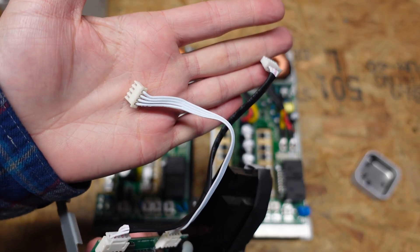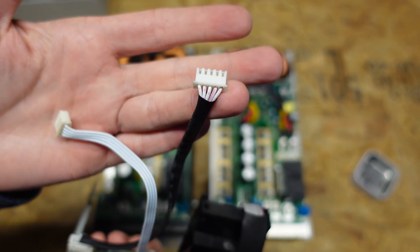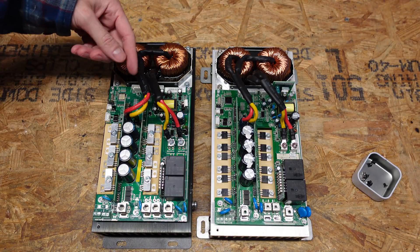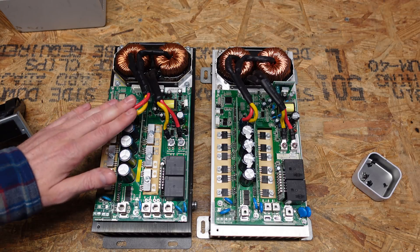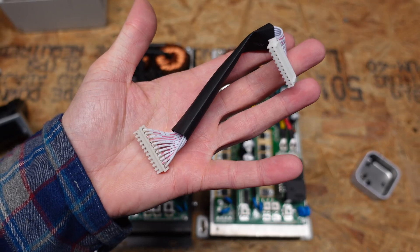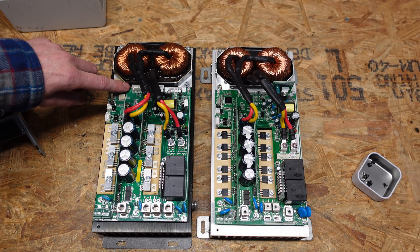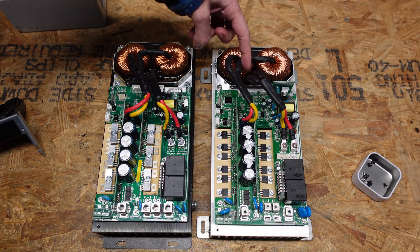The communications board connects with a four-pin connector on the left and a five-pin connector on the top — one connector goes here and one goes up here. And this controller has the exact same ports located in the same positions. Additionally, on the PCM60X we have a larger connector that went from the top port on the upper left to the front display with the buttons, and we also see the same corresponding connector on the right side.